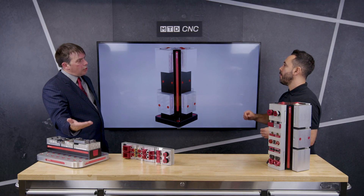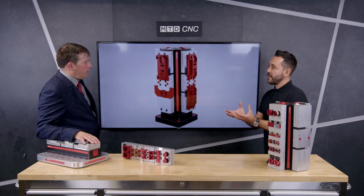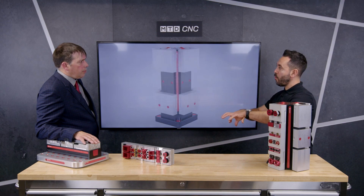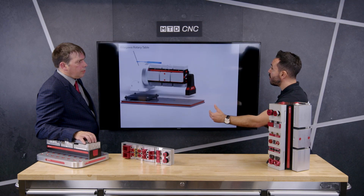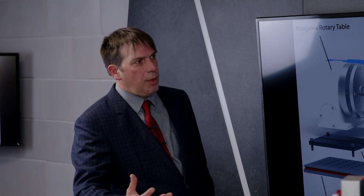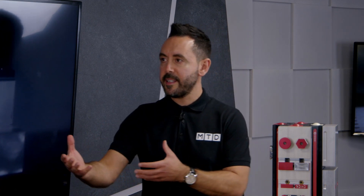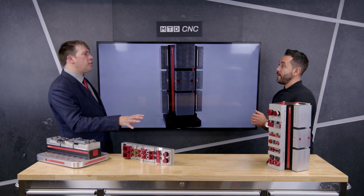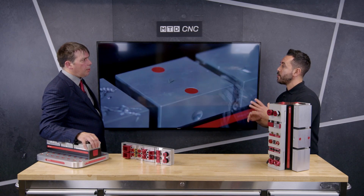So with quick locks on a three axis machine tool you're doing two-up, opposite-side machining. With the ISS you're presenting three sides of the component to the spindle at any one given time, and with op one and op two you're effectively doing six-sided work in one cycle. You can put raw material on and finished workpieces off, so from your first cycle you've got finished workpieces. If this was a three axis machine tool needing six-sided work, it would require six operations — on an ISS you can do it in one cycle. Game changer.